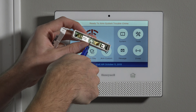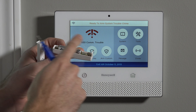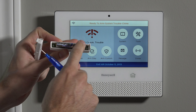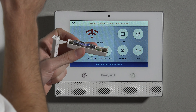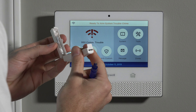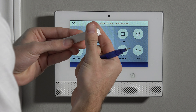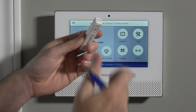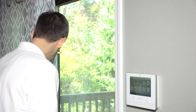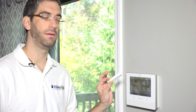There's a nice big positive indicator right on the circuit board so you're not confused about which way the battery goes. You just insert it with the positive side towards the positive connector, and close up the sensor. There's a little latch or hinge at the bottom, and you just snap it shut and click that tab into place. Now our 5820L has power and is ready to be programmed.